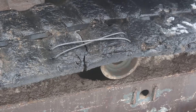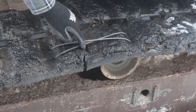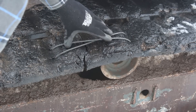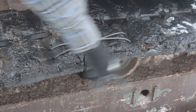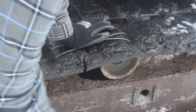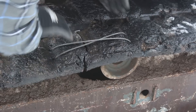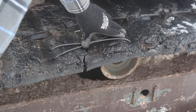Here you have an example of where the excavator track had been tearing — ripped in half right here between the two cleats. Because it was open right there, when it would come around the end of the track, around the big pulley or wheel on the inner side, because of this crack it would want to come off track.